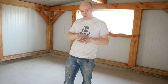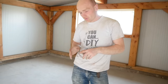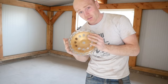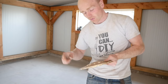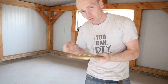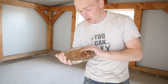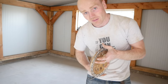This morning when I came back in it wasn't a polished finish but it was nice, smooth, and had almost a slight sheen to it — you want to knock that off before the epoxy stage. If you're using epoxy over an old floor or even self-leveling like this, it's got to be keyed. One thing I found is this diamond wheel works really well at evening out the little swipe marks from troweling between batches. It's probably equivalent to about 40 grit, and if you're careful working in small circles it's great. I was using it on the variable-speed polisher, but I destroyed the motor on it — this is a weighty disc meant for a floor machine or an angle grinder. I did about two thirds of the floor with it before it died, then switched back to the sander with 80 grit.